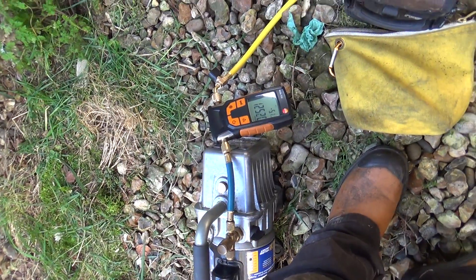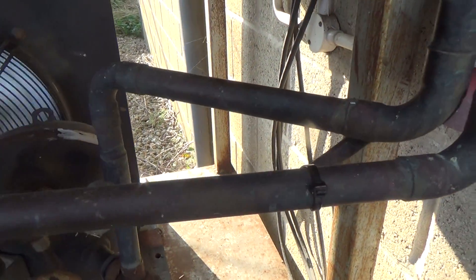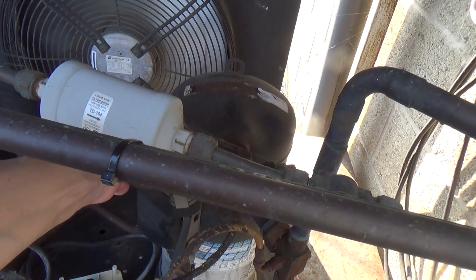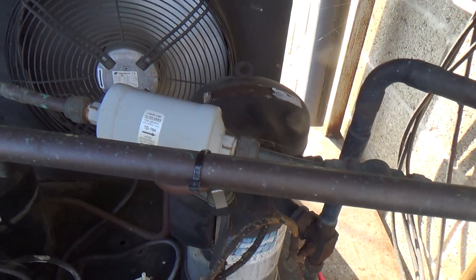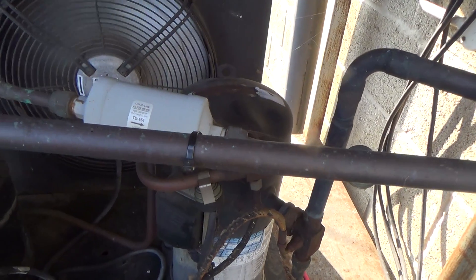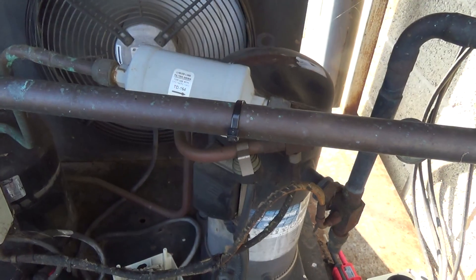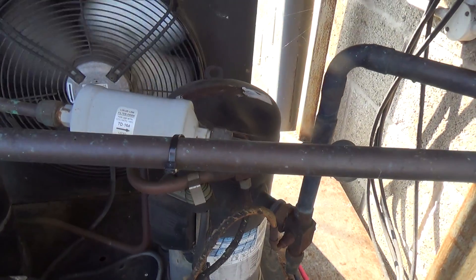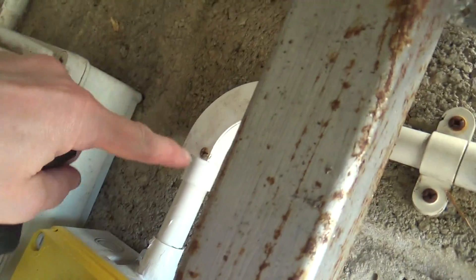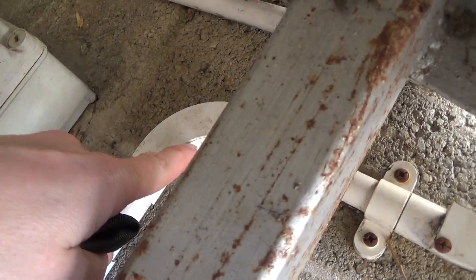Down to 12,000. It's the moment of truth. Sounds not noisy. We've got heat in the discharge quite straight away, so more than likely going the right way. The pressure should come down. Fair enough — pump it down. There we go, happy days. We've bunged a load of silicone in there on the top of this and in where the wires come down. I've filled that up as best I could, so hopefully anything that does get in is just going to come out of that gap there.